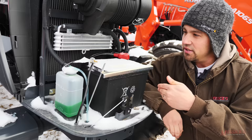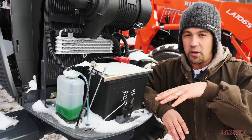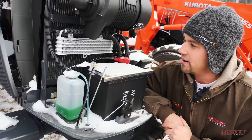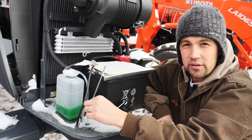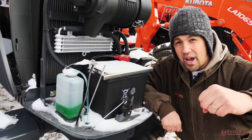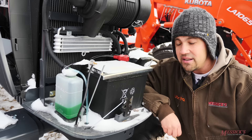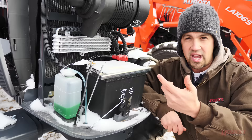Another thing we can say to a new tractor owner: don't freak out if you see a little drip or a puddle on the floor. Every fluid reservoir on the tractor also has a breather. What a breather does is — if something is a little overfilled or splashes out — it allows that fluid to spill out of the reservoir as opposed to building up pressure and potentially cracking or damaging something. You can see one of these breathers right here on the radiator. The radiator overflows into this reservoir and can also suck fluid back up. If it goes overfull, there's a little tube in the front that allows it to flow out and drip onto the ground. When we prep a tractor for sale, our mechanics top off every fluid reservoir. If they got a little too much in there, it's very possible some of those fluids may spill over and drip onto the floor. Obviously, if you see a big puddle, check that the reservoir isn't actually leaking. A couple of drips on the floor is perfectly normal.